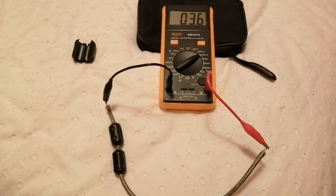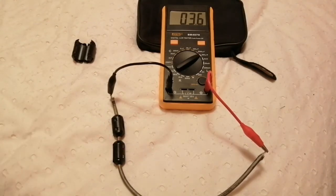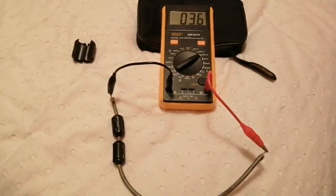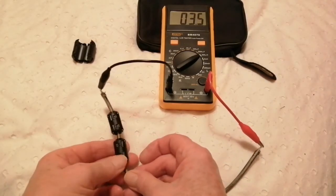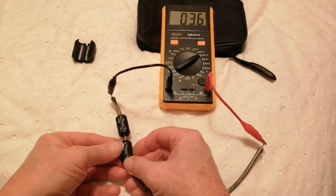Just as a final corollary to this. Normally when you choke the outer of a coax you expect that the choking will only affect the current on the outer of the coax and not the inner. Is that true? So let's have a go. I've still got these two ferrites on here, because it's easier to take them off than it is to put them on. We've got 3.6 micro henrys for this chunk of cable and I'm going to take one of these ferrites off.